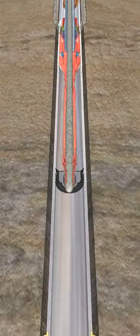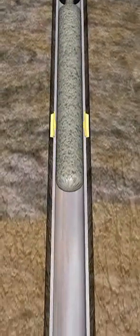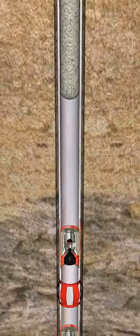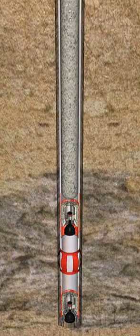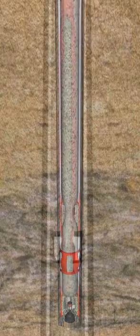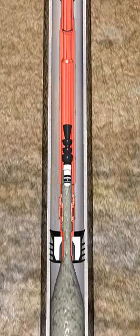Once the shoe has landed and the hanger positioned, surface cementing equipment is lined up and the cement job is pumped through the system. The wiper dart is launched directly behind the cement, wiping the drill pipe and latching into the SSR top plug set, which shears at a preset pressure allowing the plug set to be pumped down whole while wiping the ID of the liner.